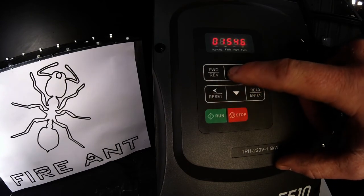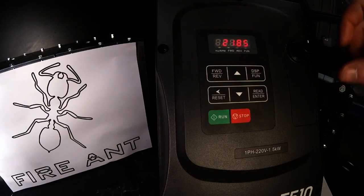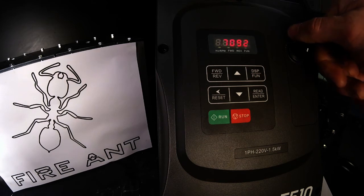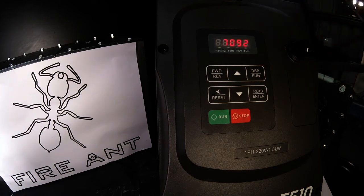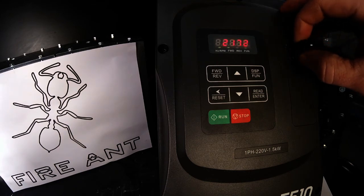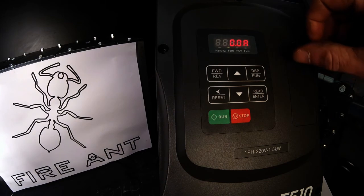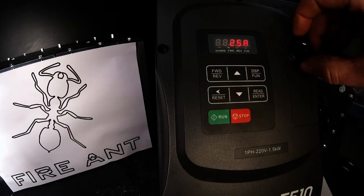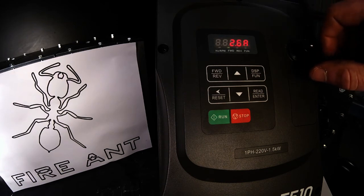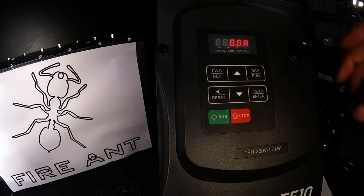We've changed it to show belt speed. At 10 hertz it shows 709 feet per minute, and at 100 hertz it shows 7092. Push the function display button again and it brings you through to the menu. Push it again and it tells you how many amps the motor is drawing — that gives an idea of excess load on the motor. Running with no belt on, it's drawing about two and a half amps, which is nothing. The start/stop buttons work, it accelerates, it decelerates — we can adjust any of it we like.